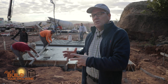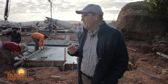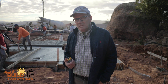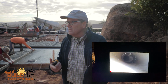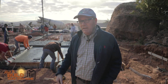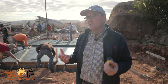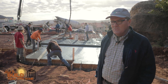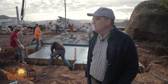We were here last night until about 11:30 and I couldn't sleep because I was worried about maybe one of the vents getting crushed. So I came out with a camera late last night and shoved it into the vents just to double check — I had a buddy with a camera, he's a plumber. Everything looked clean, so I was able to sleep, wake up early, and now we're pouring the concrete. It's a perfect day today — not too cold, not too hot. We wet down the dirt before we started pouring because that concrete wants to pull moisture from any source it can, so we wet down the pad really well — not muddy, but nice and damp. Got our inspection this morning, and we're going to pour all this and be done later this afternoon.